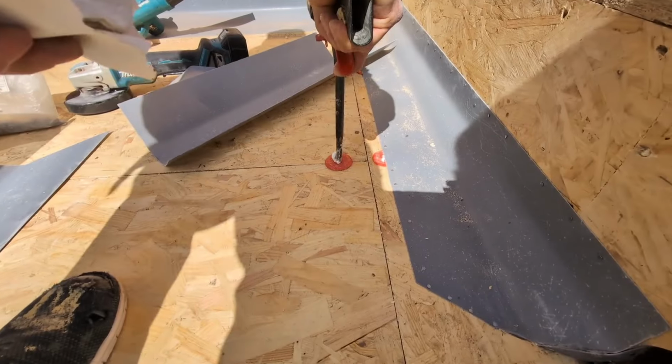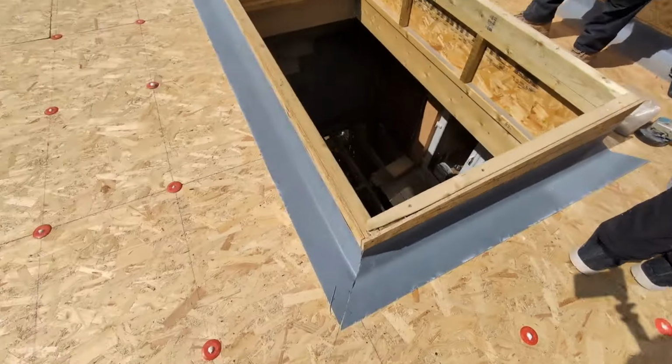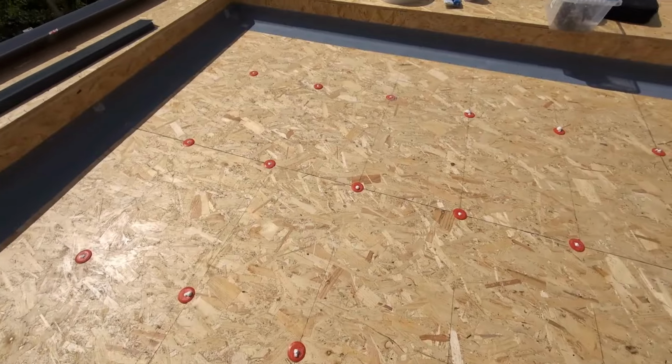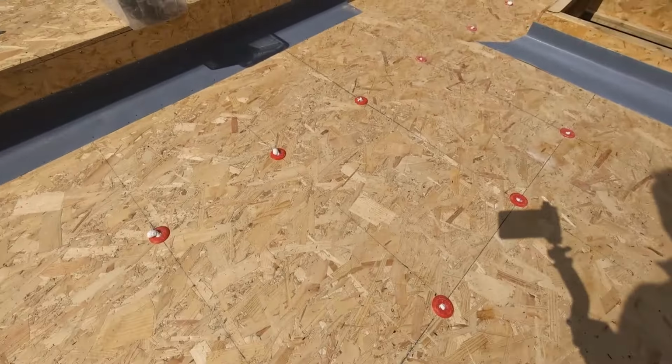If you fall into them, you won't get it as thermally efficient as it possibly can be, and that is the whole point. You've got to get things nice and tight, get that insulation in there, make sure you use the right amount for a start, use the correct vapor barrier, definitely use those thermally broken fixings into the rafters. And once you've used them, before you roof it, fill the hole up, just the hole that the screw goes through. A bit of filler, silicone, foam, whatever you want. What we don't want is an air gap that can contract and expand over the years and cause whatever roof you pour over it to fail.